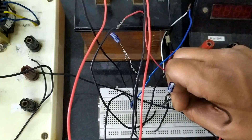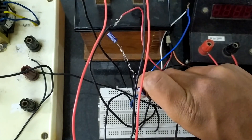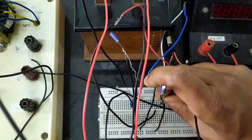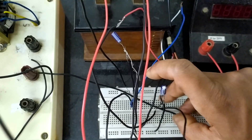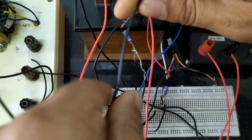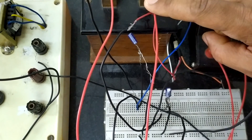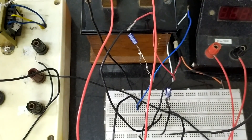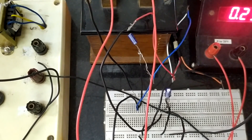This is one terminal of the load — I am connecting this to the capacitor. The same point will be connected to the positive terminal of the voltmeter. Make sure they are all along the same column. The other terminal is connected to the negative, and there is a connection from here to the negative of the voltmeter. That completes the circuit connection. Let us switch on and see what happens — and make sure you have unplugged some of the resistances before switching on.